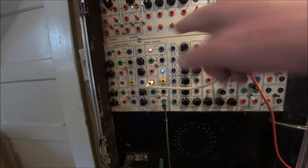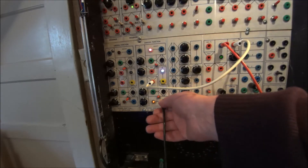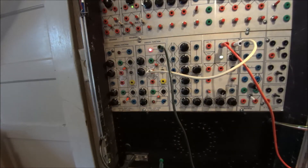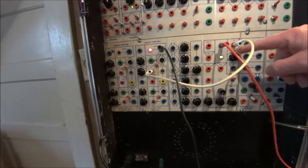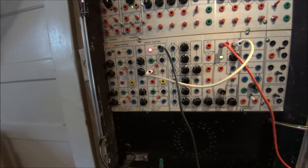It's real straightforward, but did you know that the smooth side can do this too? Here's how it works. We'll take the output voltage and let the window go to the hold. The window becomes an important thing when we do it with the smooth side, because we need to have a duty cycle that will hold this for almost as long as the interval of the clock itself. Otherwise, we would hear slewing and portamento and other sorts of things.